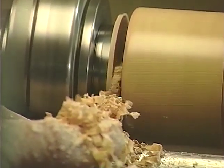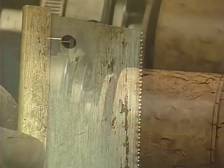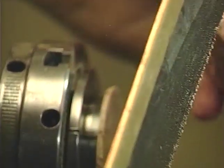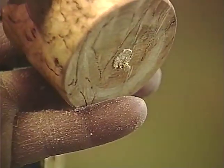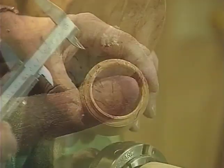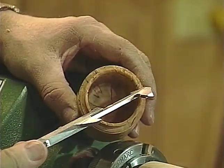We're now ready to cut the base off with a saw here. This is again for safety and stopping tear out in the bottom of the piece. All that needs to be done now is to tool the bottom of the box. We check the dimensions with a vernier caliper,